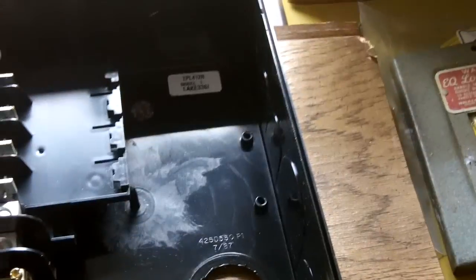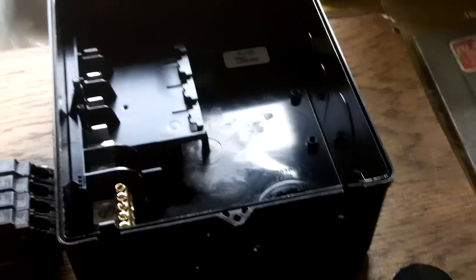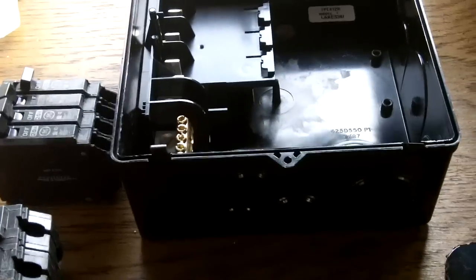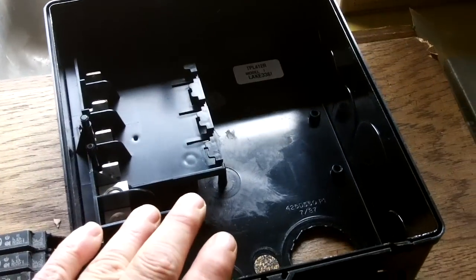I'm going to use the hole I already put in here because those wires sticking out of the wall are so short. You would literally have to remove the wall to the next fixture on either one to rewire it — I'm not going to do that. So what I'm going to do is pigtail those short wires, and it'll all end up pigtailed inside the box.